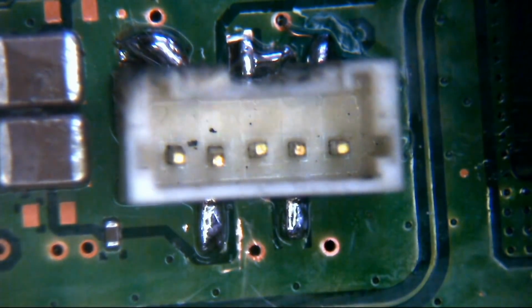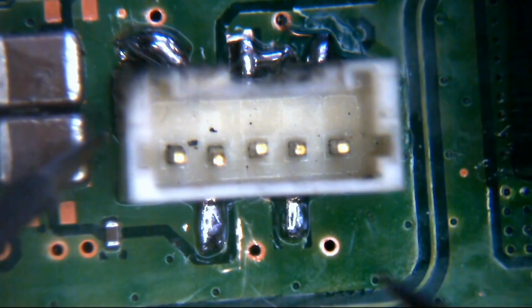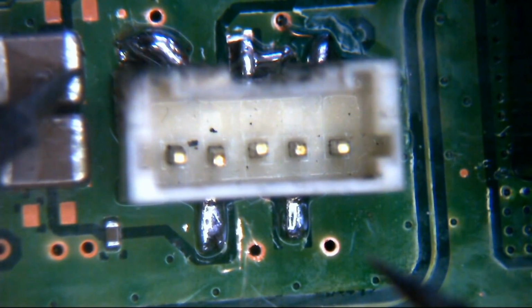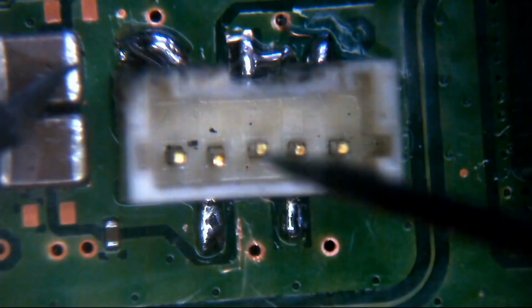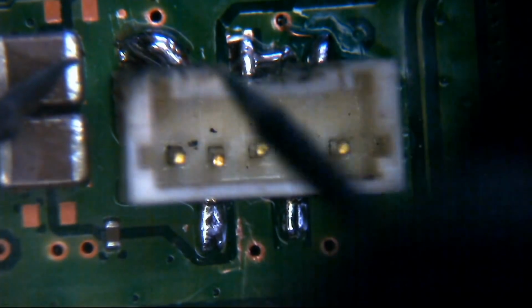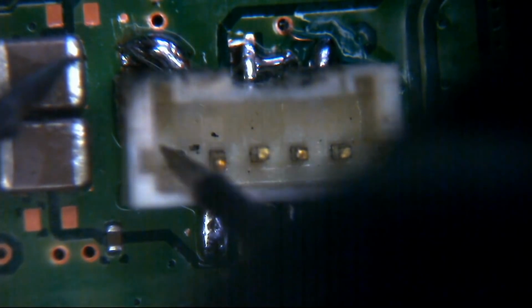So that's another part of the battle. So let's have a look then. 5-volt pins. Okay, so again we're going to use our test points here at the end of these capacitors. We'll go from the pins in the end of the connector, even though this is really difficult underneath the bloody microscope. So these N2 pins here should give us continuity.